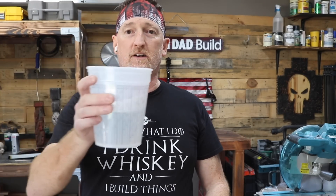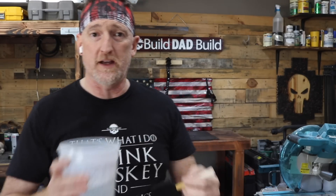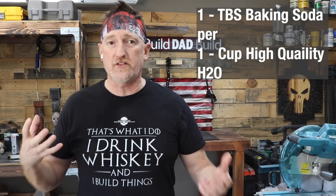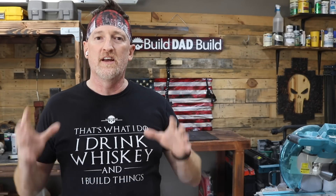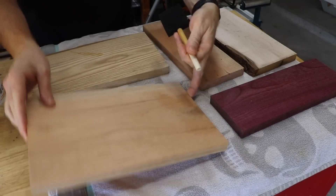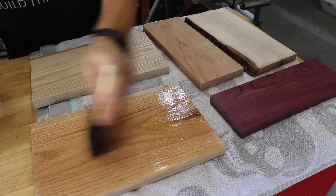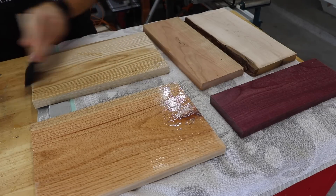Prep work is as follows. I have here two cups of water and two tablespoons of baking soda — so a tablespoon of baking soda per cup of water, pretty much the best solution. You need to introduce some electrolytes into the wood or it won't conduct the electricity very well. So what I'm doing right here is just painting this on. We're going to let that soak in and come back and hit it one more time right before we get ready to burn.